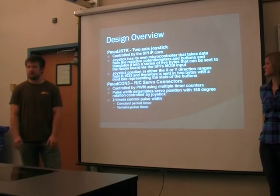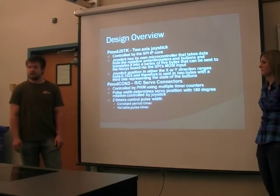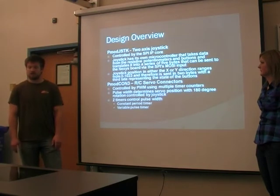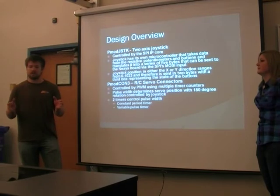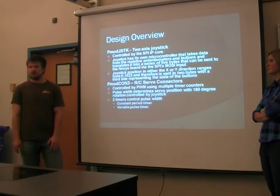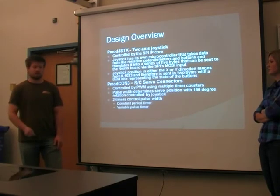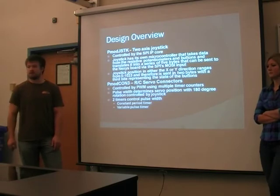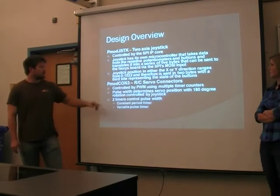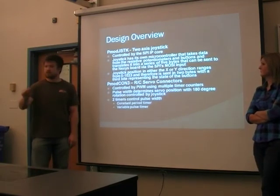The remaining bits don't actually do anything — as you send one in, another one pops out the other side. The X values for the joystick position are in two separate bytes because it's a 10-bit number. The low bits come in the first byte out of the joystick, and the high byte comes in the second one. Y is the third and fourth bytes. The range of values is 0 to 1023, so as you move the joystick from left to right, it adjusts what values come out of the GPIO.